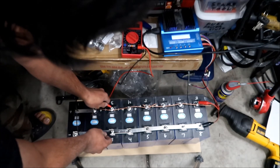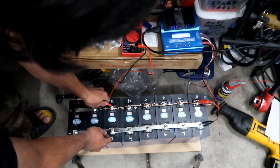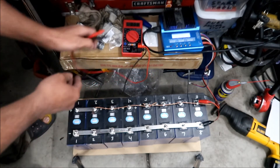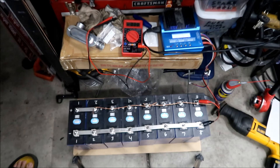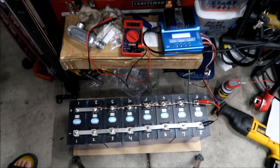Checking with the multimeter, it's reading 3.26–3.27 volts, moving around a little bit. Check it every once in a while. The charger display shows 3.59 volts, so it's almost fully charged already — looks like they ship it at about 80% capacity. When it gets to about 3.6-something it will stop. Right now it's charging as one big 3.2-volt battery pack.